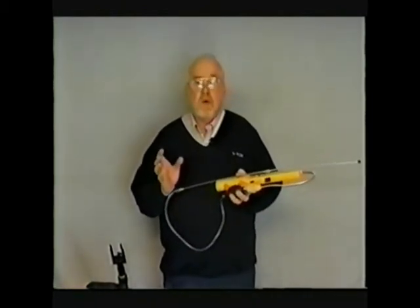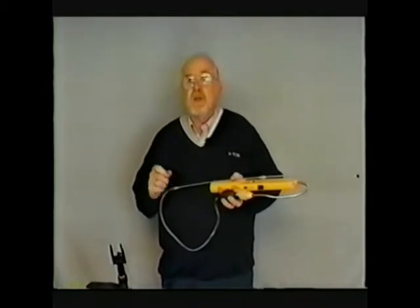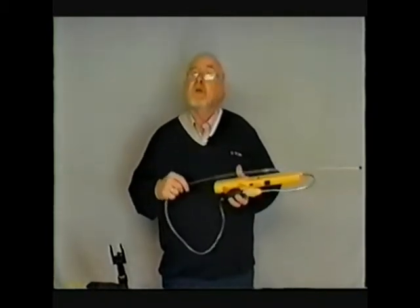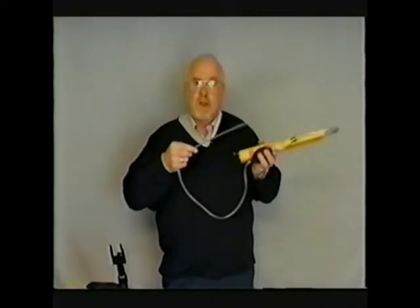You could have gas in the ductwork or in the conduits. You never know — this manhole could be near an old gas station whose tanks have begun to leak, or it may be located near a dump. Dumps generate methane. So again, utilize the probe, get it into the ductwork as far as you can, and do your sniff test.